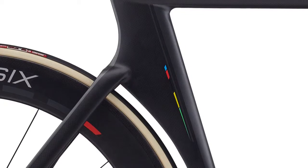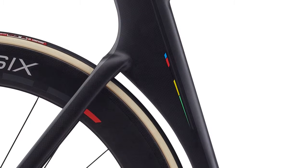Carbon fiber is also great for strength, where we need very high strength applications like fork steerer tubes and things like that. With carbon fiber, we can really build a bike that is much stronger and certainly stiffer and more rugged than what we could out of a metal alloy. You could manufacture the bike to be stiff in one direction and compliant in another. You can design things like integrated leaf springs and full suspension bikes, and you can have bikes made exceptionally stiff and aerodynamic, like our Olympic track frames.